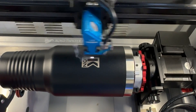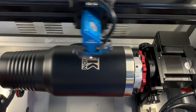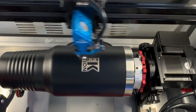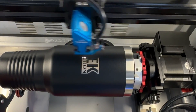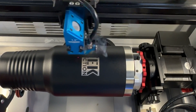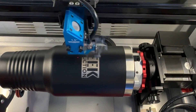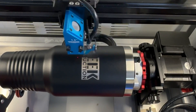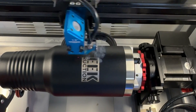With these particular settings I'm using the inch-and-a-half lens. You can see that I'm going to have very little cleanup to do when I pull this tumbler off the bolt. You can also see how nicely the fan is working to pull that smoke to the back of the laser.